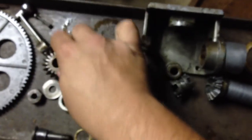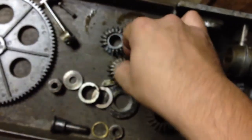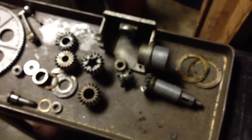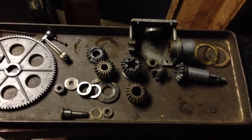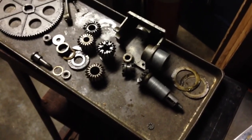I'm gonna machine this one to look like this one. This one goes up in the top of the gearbox. You can see the difference — just need to take off a little bit, bore that out, and we should have a good working screw-cutting lathe again when I get through with all this.